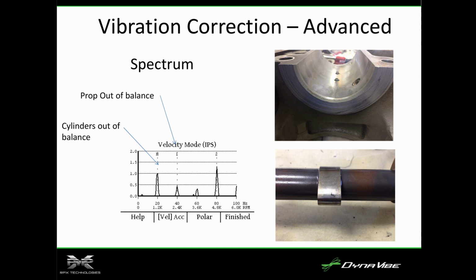We pull the cylinder. Underneath that is a big piece of the cam missing, a lot of corrosion. We tear that down, and then we notice that all the corrosion had single specks on it. So it was one event. The guy had left the oil pan heater on one time, and that had caused condensation that then pitted the whole engine. So be careful with that this winter.